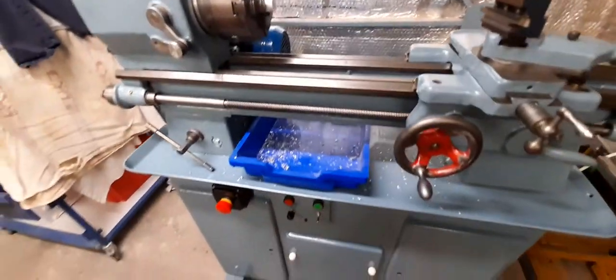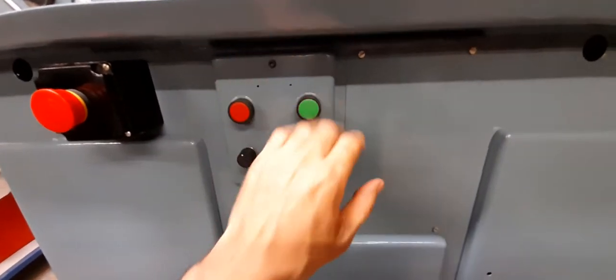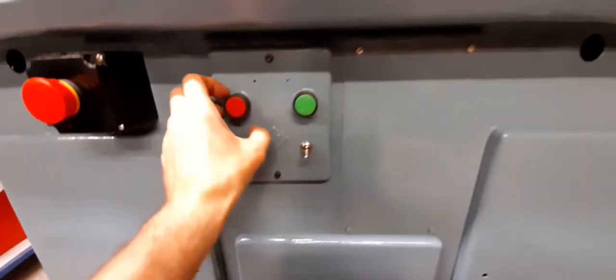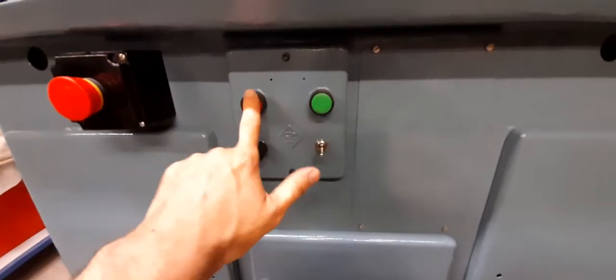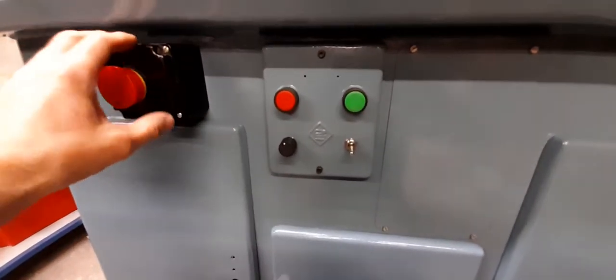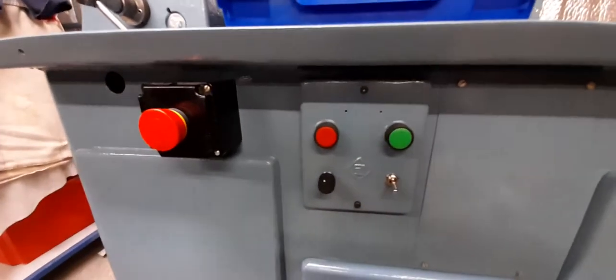I changed what was a single-phase motor for a three-phase motor and I'm very happy with that. I retained this old panel cover — I had to mill down the flats and around the back to remove some material so I could get the new switches in: the emergency stop and the stop. The emergency stop is actually just a latching stop switch, while the other is momentary. They're wired in series. I could wire up a true emergency stop, but if you aggressively stop one of these lathes with a screw-on chuck the chuck might come flying off.